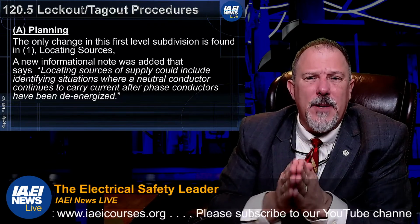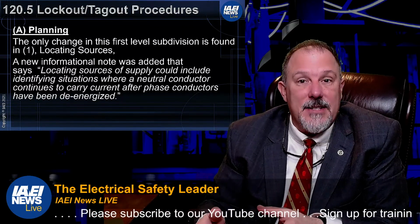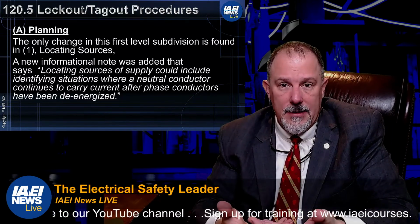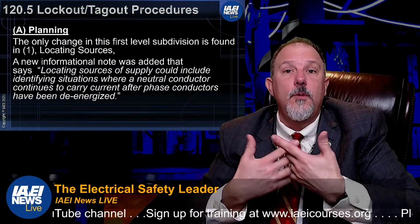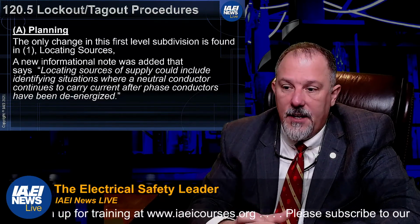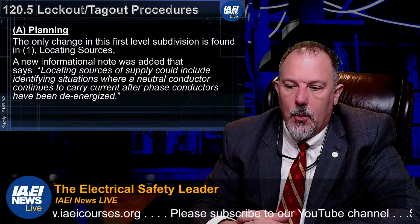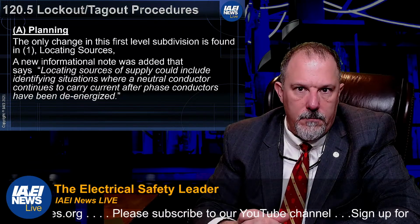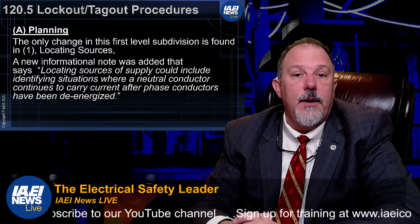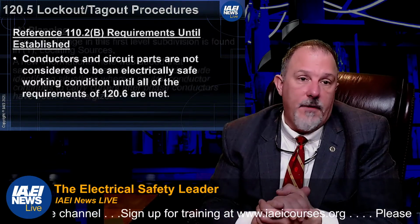We can't underestimate the grounded conductor. We call it the grounded conductor, but it carries current in many cases. That conductor carries current, and if you become a part of that circuit, that's the return path. You become a part of that circuit, and that current will pass through your body. That is a very important thing to remember, that you can become energized. And the informational note is just raising the awareness of that.